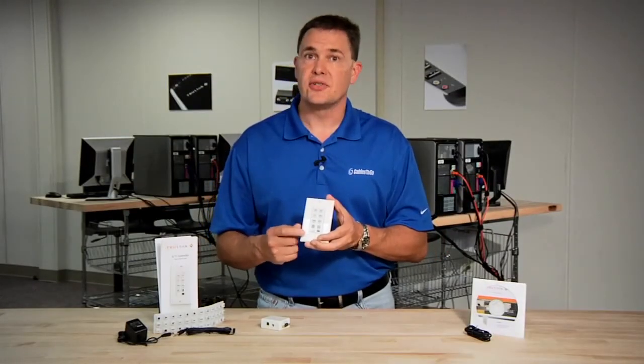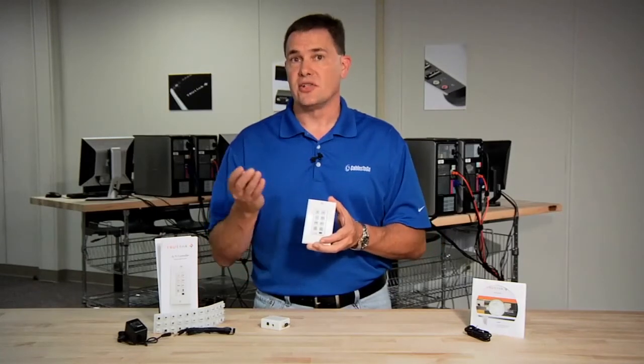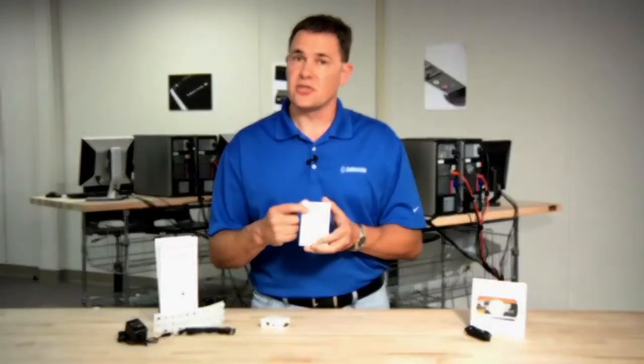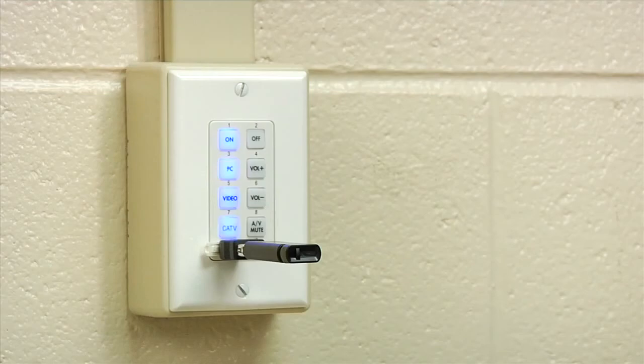We can also download. A perfect example would be if you go into a classroom situation and you're installing a new controller in a classroom next door. You could take the known good script from another controller, download that to a memory stick, take that memory stick to the controller next door and upload that, and simply repeat for every classroom you need to do.